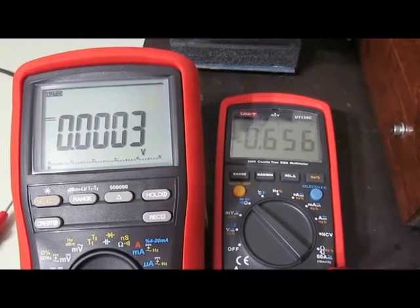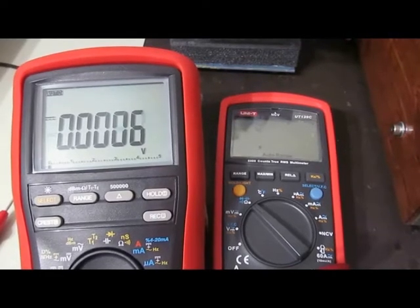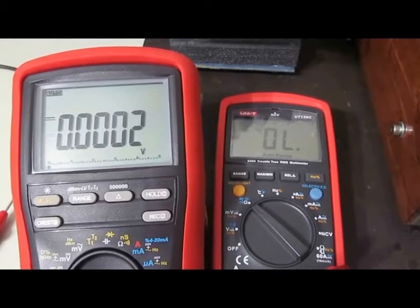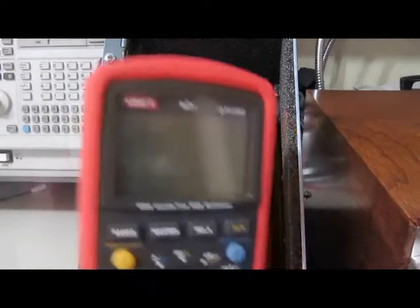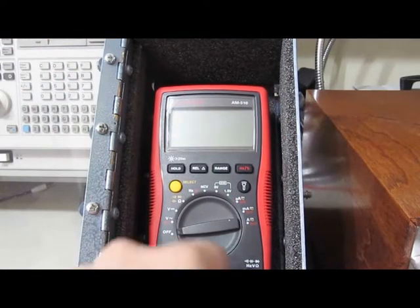This is with a single diode, 2 and 3 diodes in series. And the capacitance mode also does not work. Normally this would read about 250 picofarads or so. Again, this is the second 139C I had tested. The original one failed quite early in the test.